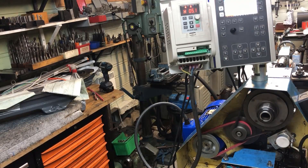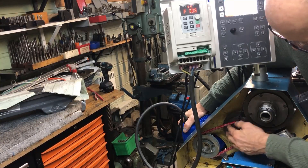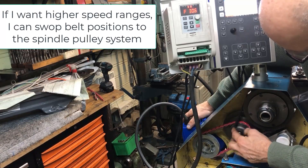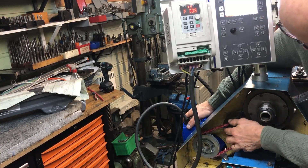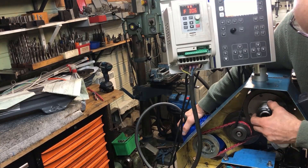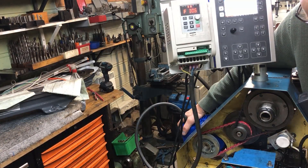This is my normal setting. I can of course then regulate to get a lower speed by undoing just the motor belt, while leaving this in place, so I think that's a good compromise. Of course you can also then use the highest conversion ratio up to the spindle. I think the usual way for me — 1200 RPM being sufficient — I can get up to 1800, maybe even 2000, by just moving to one of the other steps, but I don't think that's necessary really, not on this lathe.